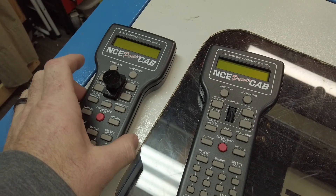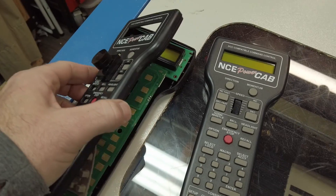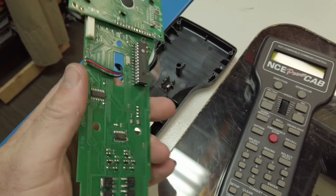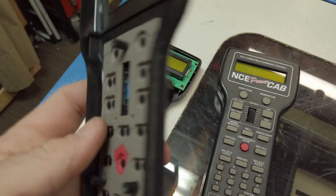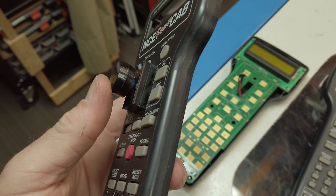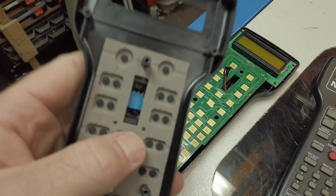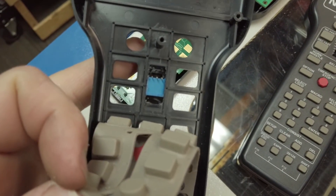So this is what I came up with. I actually took the encoder out, unsoldered it from the board — that's where the encoder goes. I unsoldered it there, put a plug on it, and then made a block and wheel. This is just temporary, just the first prototype out of acrylic. It all unplugs because otherwise this thing doesn't fit through. All I had to do is mill out a little bit so it would fit in there.